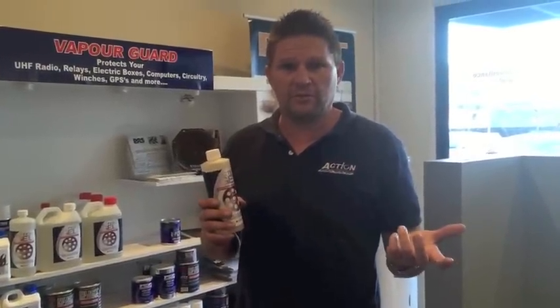The key to a successful metal restoration project is rust removal rather than relying totally on rust conversion. The problems associated with relying on just a rust converter is that if you put too much of the product on, it leaves an acidic surface. If you don't put enough on, it doesn't go through the layers of rust and convert all the rust, which means later on rust can pop through a coating that you put on top. It's for this reason that products that are purely converters are not permitted in some areas of steel construction.